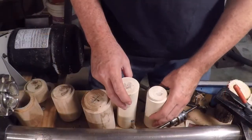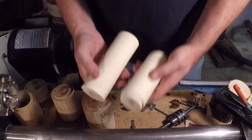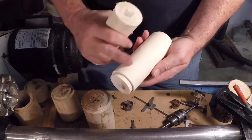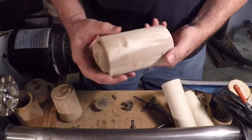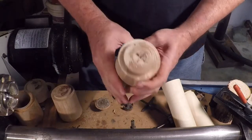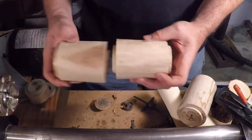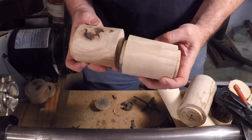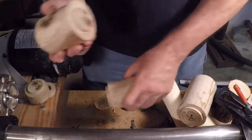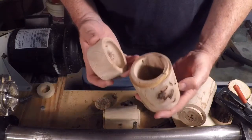I had a busy day turning down some of these green branches into blanks. One branch produced this real yellow-looking wood - it's lightweight but when I sanded it down it has a nice tight finish. It doesn't have a lot of character but I think it's a stable wood to work with. I suspect it could be poplar - it's got two tones and a slightly green tint to the lighter tone. Then there's this branch which I'm pretty certain is oak - it's a very firm hardwood, and it turned very nicely when I was cleaning it up.